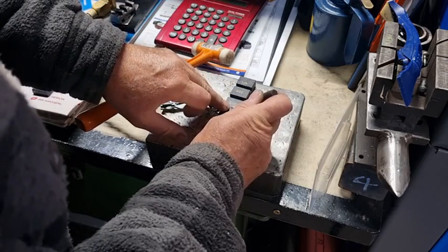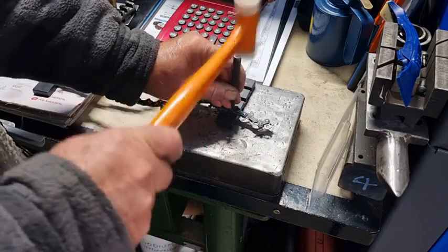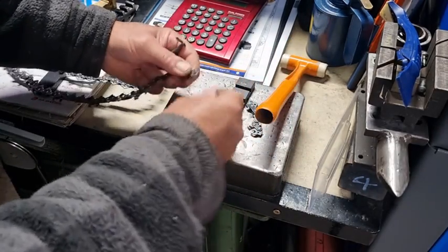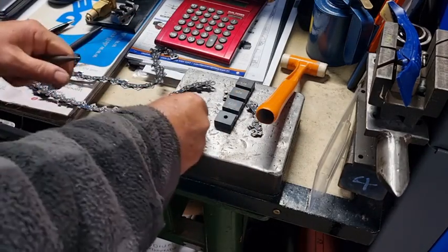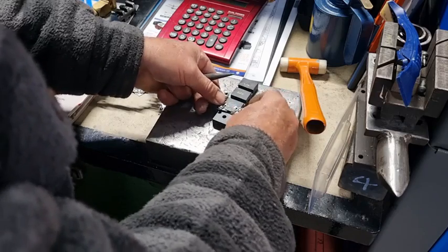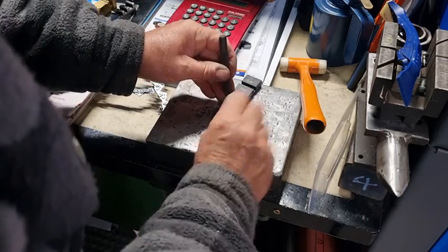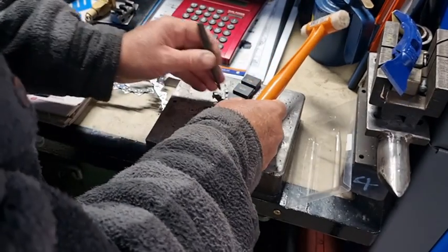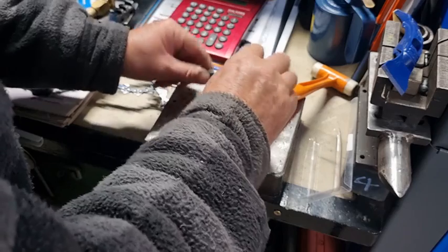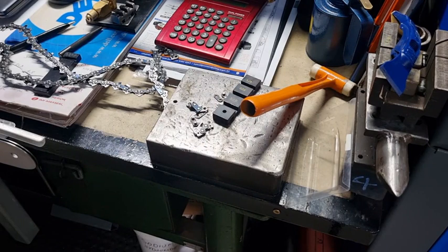Because when you've ground it off, it's sometimes a little difficult to see the centre, but I'm just using a nylon hammer here — barely a tap and I've already just broken it. Look how easy it is to break! I'll just do that again with another one. It's a lot safer too — you don't want to be using a big hammer. This one's a little bit harder... there it goes. That is a lot easier and a lot safer.